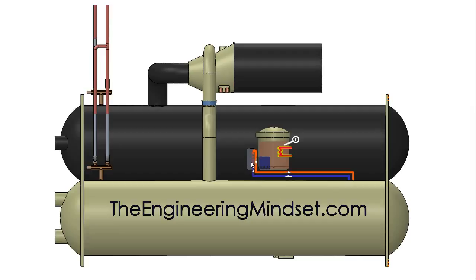The cooling fluid flows into the heat exchanger, takes any excess heat away, and then recirculates off to be disposed of. The sump pump pushes the oil through the plate heat exchanger, transferring any excess thermal energy it doesn't require, and the oil makes its way up to the top of the compressor unit. There is a temperature and pressure sensor on this line, which is very important — the chiller will not be allowed to start until the temperature and pressure in that line have met the required set point.